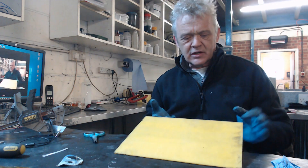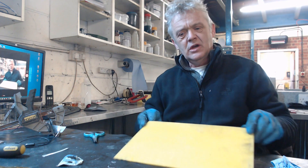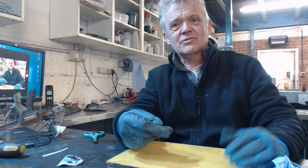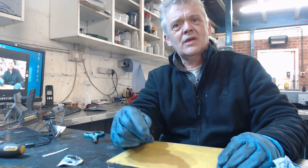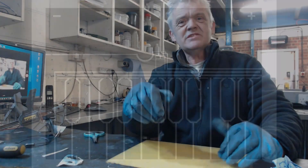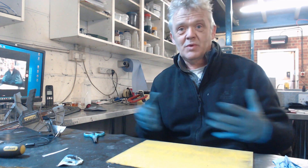What I've got here is a bit of yellow acrylic with a bit of PET on top. I'm going to paint that PET and then put it in a laser cutter and cut out a circuit. The circuit I'm going to do is basically a stylophone — it only uses two components plus the circuit, because the circuit contains all the passive components. The resistors and capacitors are part of what's been painted.